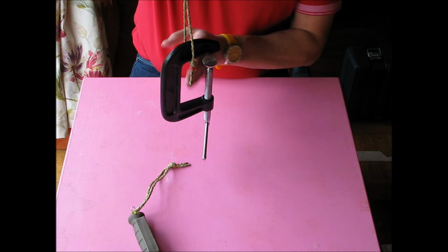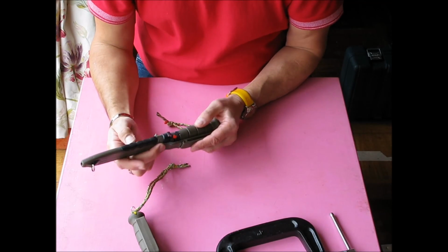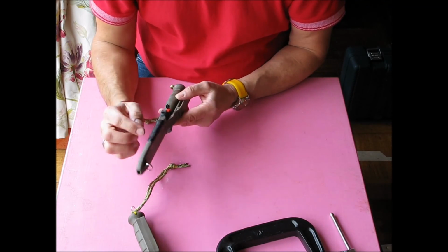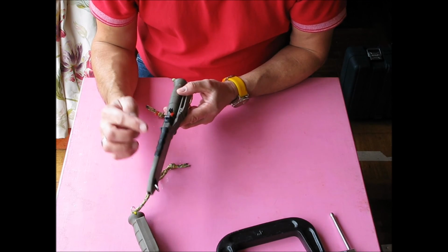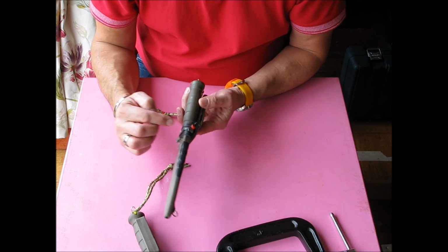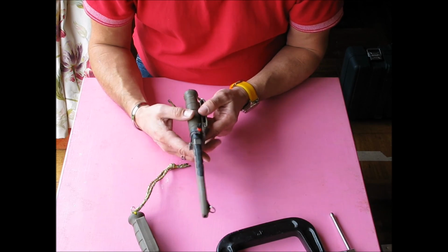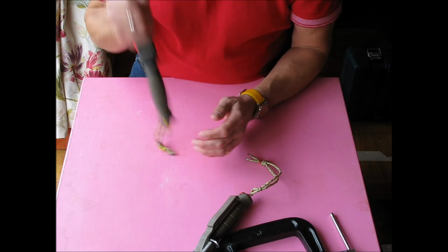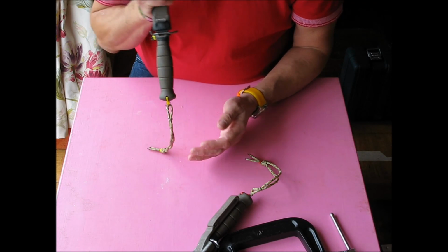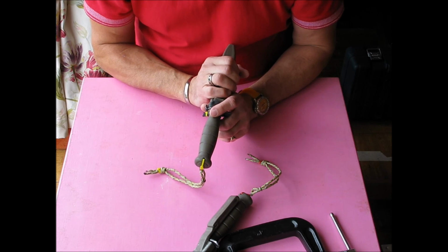So what I would take from that is that the minimum weight you can get from putting these really very small magnets in here, 4mm long by 4mm in diameter rod magnets, by having 5, 6, 7, 8, the minimum weight you'll be able to carry is about 900 grams, and that I think is absolutely adequate for what I want it for, actually wearing in a stationary kind of camp situation. There you go, that's what it looks like.